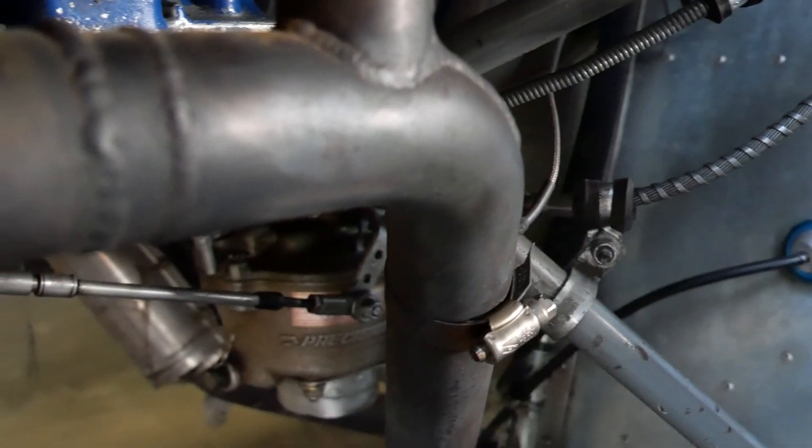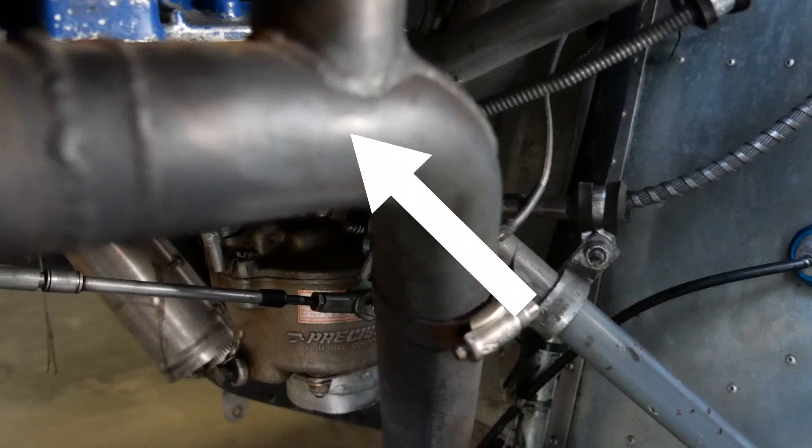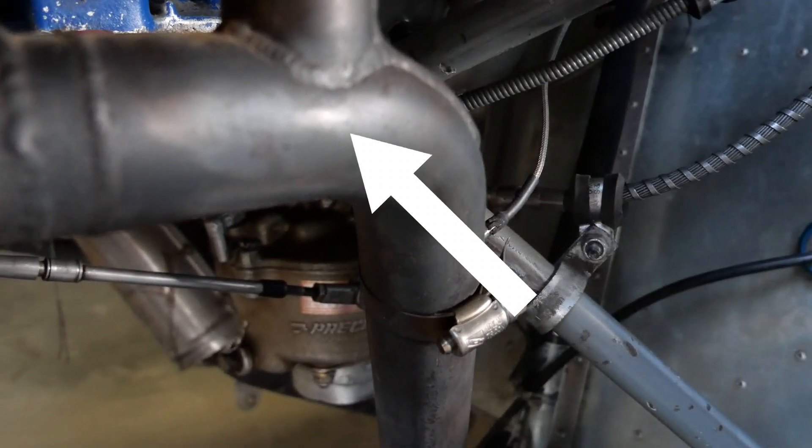As far as inspections go, everything looks good. The only thing we had on the engine is a single crack on the exhaust stack, and we'll be able to weld that out again according to AC43. Now the wing — I've got it back there in the back, I did tear that apart, and let me show you what I found on the wing that impacted the ground.